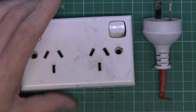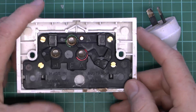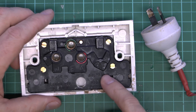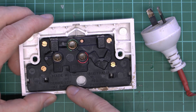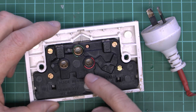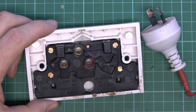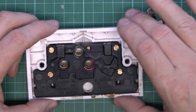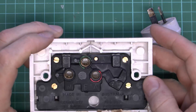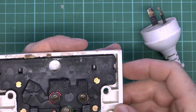So typical Australian outlet there, and the two-pin plug. Have a look on the back — you can see it's an HPM brand, made in Australia. This is a Series 777, and it's just got three terminals there for the active, or the line as we call it here, earth, and neutral. Both switched on the front there, so just got the two switches. And for some reason the back plate is upside down with respect to the front.